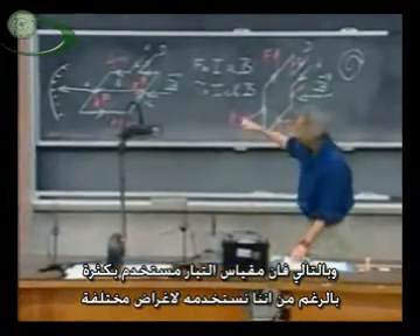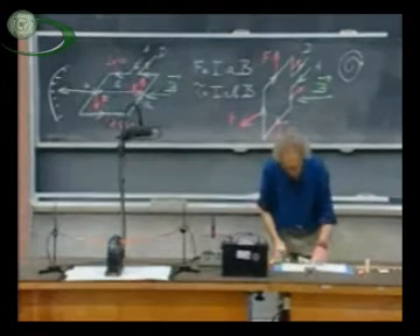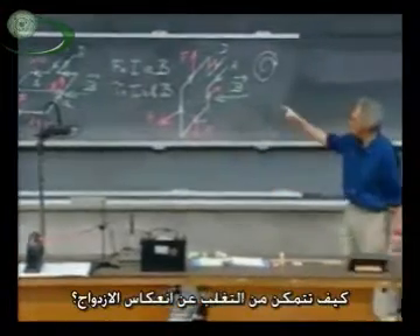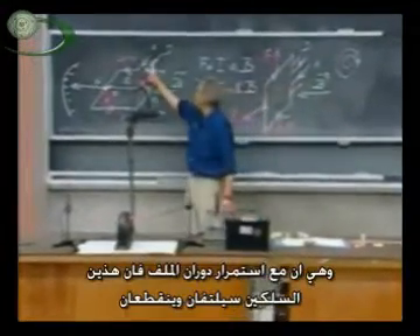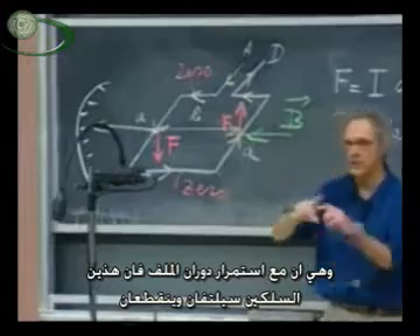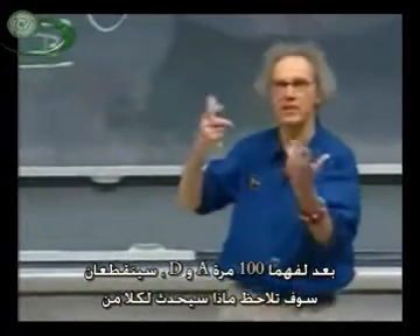Current meters are very common, something that has nothing to do with current. How do you build a motor that works? How do you get over this torque reversal? It's not only the torque reversal that is a problem, but there is also the problem that if you could keep this going around, these two wires would intertwine and they would break. If you rotate it around a hundred times you can see what happens at A and D — it will break.